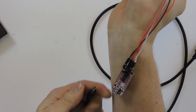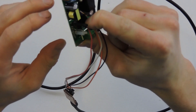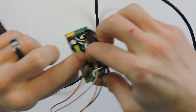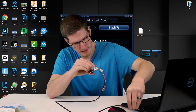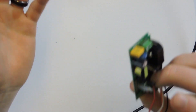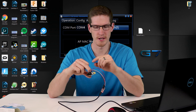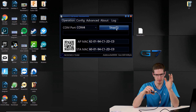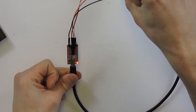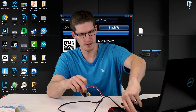Apply constant pressure to maintain good contact. You'll need a third hand ideally, because you need to hold the button down, then plug in the USB cable, and then you can release the button — while keeping constant pressure on the four wires. Once plugged in it should be recognized. You hold the button to put the Sonoff into flashing mode — if you see a green LED flash, it's not in flashing mode. Now click Flash; it takes about 15 seconds, and you can verify flashing by the green LEDs on the FTDI adapter.